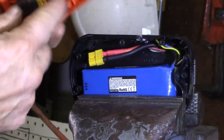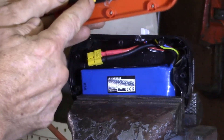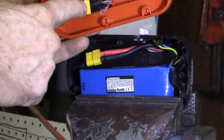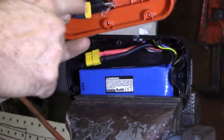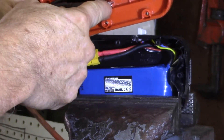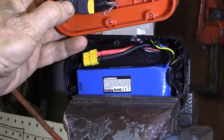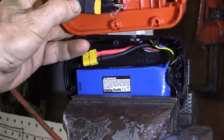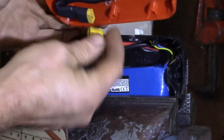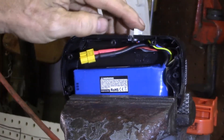You have to get this — it's a really tight fit. There's just enough room to get this piece in here, so you need to just trim the wires to just barely fit in there. You almost have to make this piece and then see where these come out. I had them extra long, just cut them off here, because with this heavy wire you can't just stuff it in the battery pack — you've got to cut it to fit. That'll plug in, this will plug into here. That goes on the top, and then the balance plug cable will plug out the side.